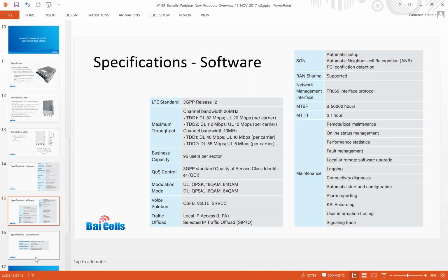do is if you have, say, a cell site that's hitting capacity with your current generation hardware, it's all Cat 4. You have 60, 70 people on a base station. You're going to push the limits, and you just need more channel bandwidth. Well, what will happen with carrier aggregation, which is what's really neat about it, is once you deploy carrier aggregation in a cell, even if it's covering the same area, and even if it's using Cat 4 devices, those users will have a set of triggers based on throughput or user subscriber count where it'll balance those 70 users, not necessarily equally, it could be traffic based, across those carriers.